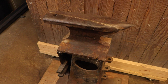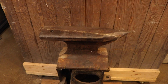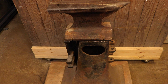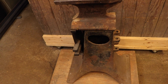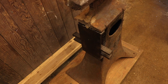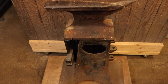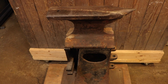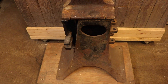Here's basically how my track anvil was set up. The base is an old machine stand — I don't know what it was originally used for, but I used it as the anvil base for the first year or so. The track anvil was bolted very securely down to this machine base and the wide base made it a very stable platform. So even though this anvil is very light, when you bolt it to a heavy base it starts to work like a much heavier anvil. When setting up your first anvil, don't underestimate the importance of attaching it to a heavy base and, if possible, attaching that base directly to an even larger base like a metal plate or the floor. If the anvil moves when you're hammering, it doesn't matter how heavy the base is — it's not doing you any good.